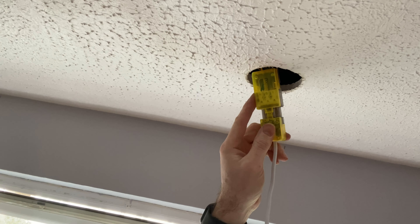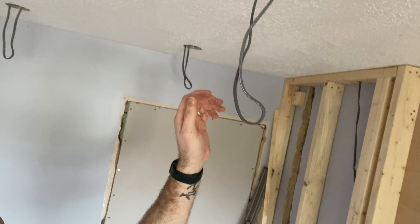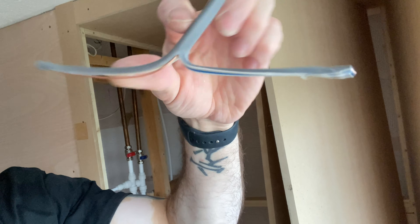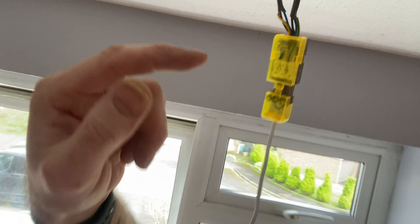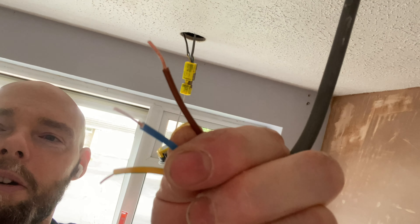Right, so here's the dangling cable connection - beautiful lovely quality up there. So I'll show you how I got to this stage. When I poke the cable through it's ready to rock and roll. Snip to the center, which brings you to the cut end. Next, split the cable so it's all ready. Take off the grey sheathing and trim it so the conductors are all separate. Then trim the ends to the length required to go into the quick-fit housing. Don't forget to put on your earth sheath - you buy these separately in little packs. And that is now ready to connect to the light block.